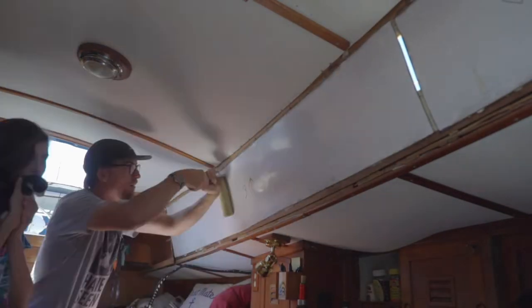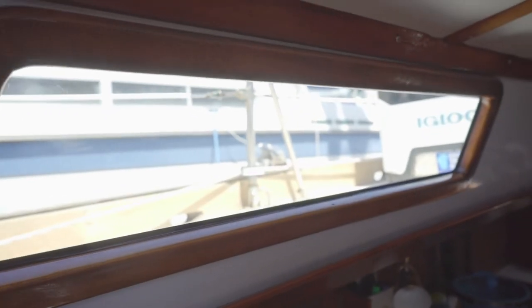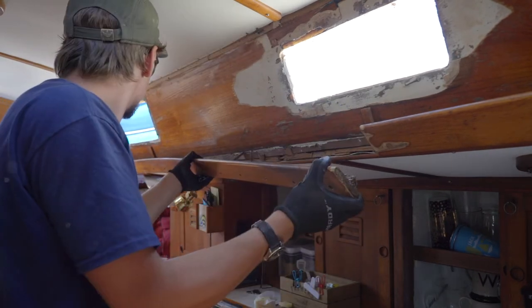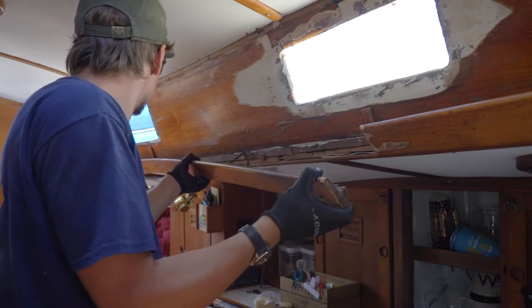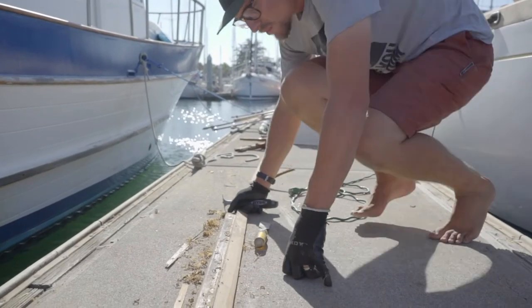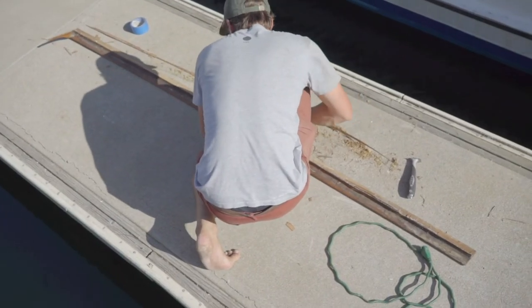A lot has changed since Avocet was built in 1979. We love teak more than anybody, but having these white accents allows the light to come in and makes this space feel more like a home instead of a cave. Installing Formica meant we had to remove our handrail. I was perfectly okay with this because our handrail looked horrible. We had a lot of water damage, and the inside finger well had about 35 years of gunk. You can never really get all that out and clean it and re-varnish it while it's on the side of the boat. So being able to take it off, completely clean it, completely sand it, and re-varnish it before going back up was fine with me. I got the handrails all finished up and the inside lip all nicely cleaned up.